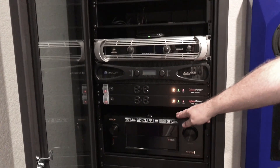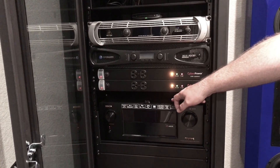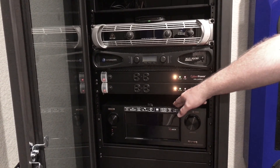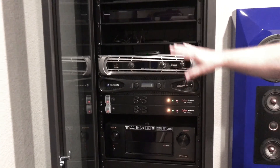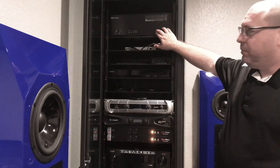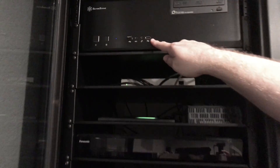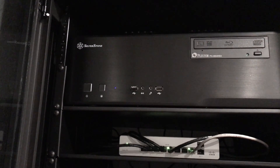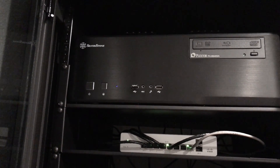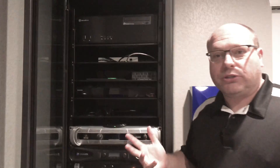Now this guy is connected back to the AVR, and the AVR is another item that we're going to have to address at some point in the near future. It's connected via HDMI, but also via a pair of RCA cables so that I can do some two-channel stuff out of that box if I want to. The important part today to understand is that this is where we're going to do our measurements with REW, and we'll be plugging in on the front of the chassis here with a U-mic 1, and that's going to be the microphone that we use. I've got a wireless keyboard plugged in, and that's going to allow us to control it. We'll film with a camera mounted pointing at the projection screen - I think it's a little more interesting when you can actually see the real screen, and that's how we're going to capture our measurements for the day.